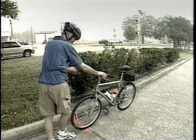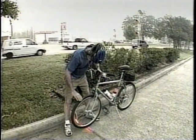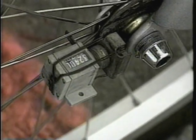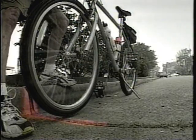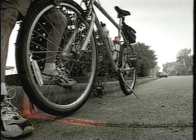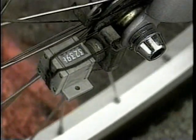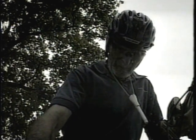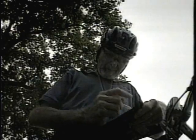Following a warm-up ride of three minutes or more, set the counter by turning the front wheel to a convenient number. Some people like zeros on the end, but that's not necessary — do what you feel comfortable with. What is important is that if you roll the counter past the mark you're looking for, you need to roll it back past that mark and then roll forward again into the count. For example, if you want three zeros on the end and you roll forward to 001, you must roll back past the zeros and then roll forward, stopping exactly at three zeros. Freezing the wheel with the brake and rolling forward into the count eliminates any backlash from the counter. Be sure to read this section in the manual.